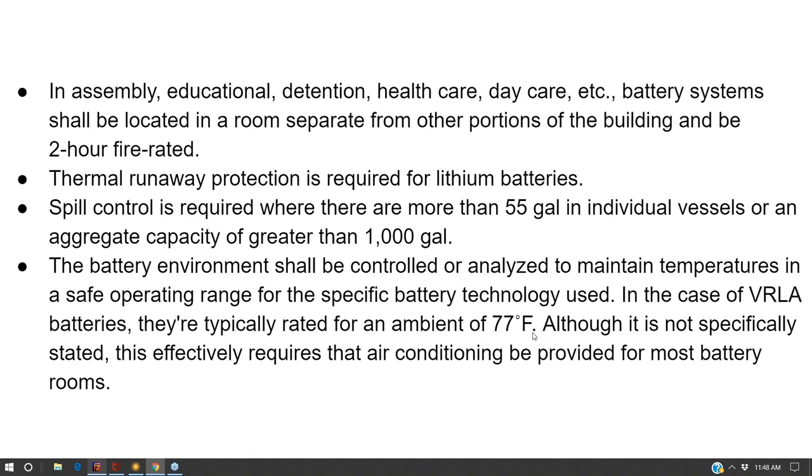Lead acid batteries are capable of accepting a high temperature range. They can go to elevated temperatures better than lithium ion can. Now, lithium ion, you really got to keep cool because when you use them at higher temperatures, they degrade a lot faster. As people are concerned about freezing temperatures, but actually, lead acid and lithium ion can get down to below freezing before they start to freeze. That electrolyte is like salt water. It really gets down to about 10 degrees Fahrenheit before the electrolyte starts to freeze.